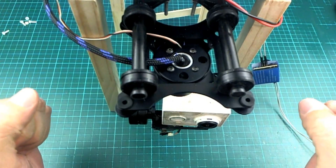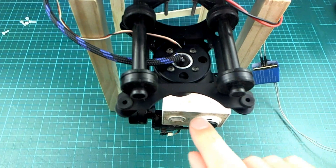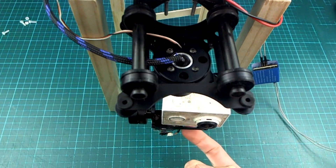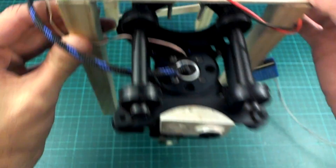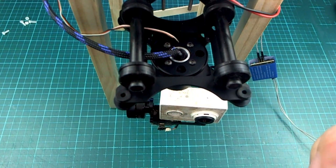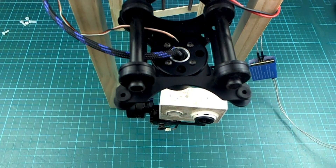I made a little wooden test platform and connected all the wires up and it's working quite well. I tuned it for this Xiaomi Yi camera - not actually the one I'll be using, so I'll have to tune again. I tuned it using a single IMU underneath, then switched the second IMU on which is on top. It sort of lost its tune, as expected according to the documentation. I found it very difficult to figure out which parameter is affecting the behavior, so I decided to just use a single IMU underneath for now.